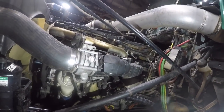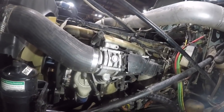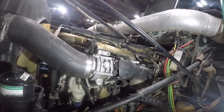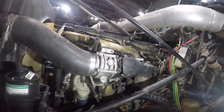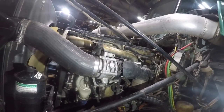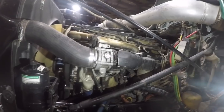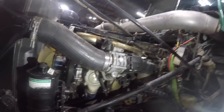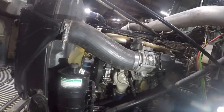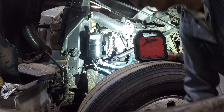So, you know, people just don't understand that antifreeze serves more than one purpose. It's more than just to keep it from freezing. It's a rust inhibitor. If it has DCA in it, which is an inhibitor for electrolysis, there's a lot of things that it does. It keeps things from rotting out and rusting out. So these guys that pour straight water aren't too sharp. So let me get some clean buckets, start draining the antifreeze out of it. Okay, we're draining the antifreeze.